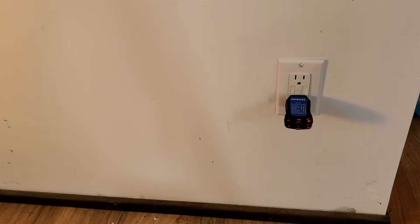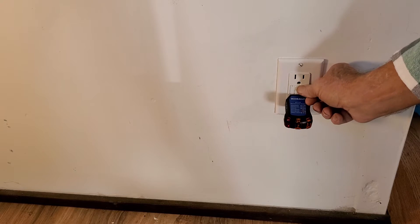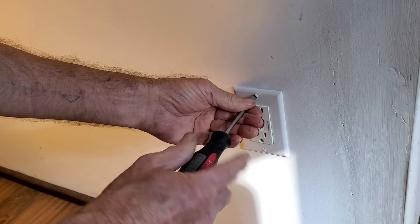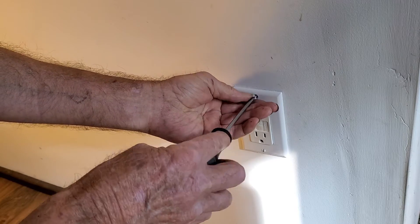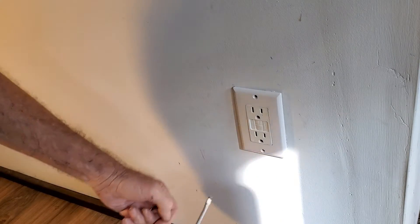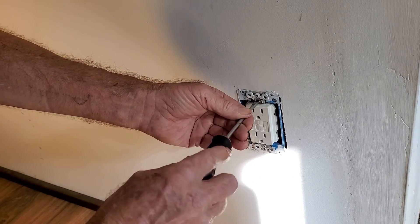The mistake made was that the line and the load are mismatched. And you can see, every time I try to reset that breaker, it's not going to work — even without the plug in there, it just won't work. The mistake was that even though there was a wire coming up from the bottom of this box, I assumed that was the line, and it was not. So when I hooked them up, of course it was not going to work. The GFI just will not work — it has to be line coming in, load coming out.